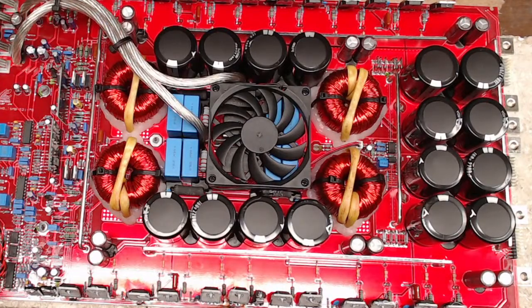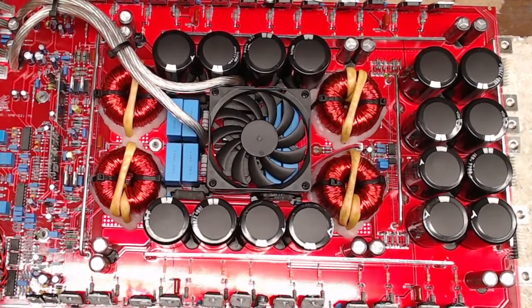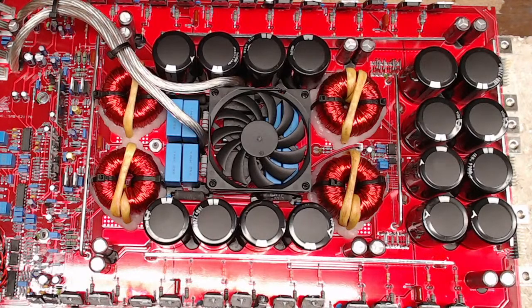So that's how I use resistance. I'm big on that. I know probably people disagree on using resistance, but resistance will tell you a lot. If you try to do the same measurement to the FET when it's not in circuit, you will get nothing. You will typically always have a resistance value, even when your transistors are out.